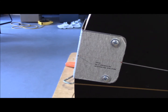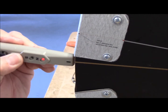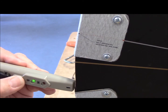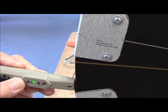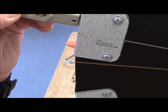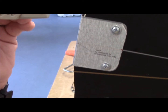Let me lower this a little bit so you can see — I actually have two magnets. I'm going dead center here between the magnets — dead zone. Then it picks up again. This magnet down here is a north magnet, so the outer edge of the magnet is south, and the center is north. There's a south edge, then a dead zone, then it picks up again on the north edge. Moving into the south magnet — south signal again, and I would say it extends about almost a quarter of an inch off the edge of the magnet.